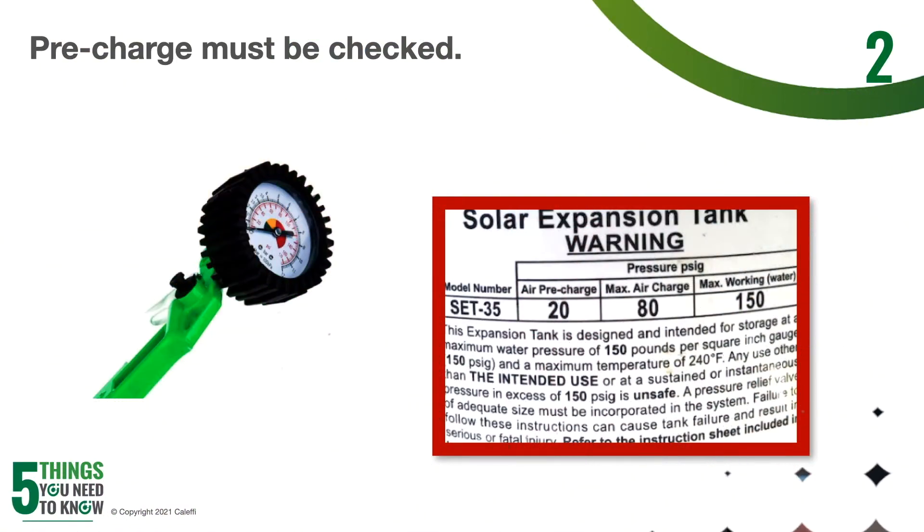Tanks are going to come pre-charged and labeled from the manufacturer; however, pressure may not match that indicated pre-charge, so always check. I would also encourage you to invest in a good quality low-pressure tire gauge, something that you can check for less than 30 psi on most systems. When you look at some pressure gauges with a sweeping range up to maybe 100 psi, it might not be accurate enough for those lower pressures, so make sure to get one with the correct range.